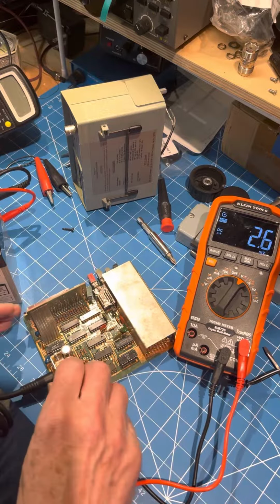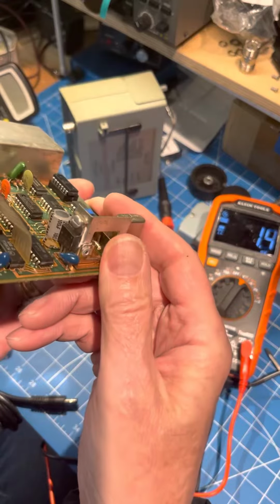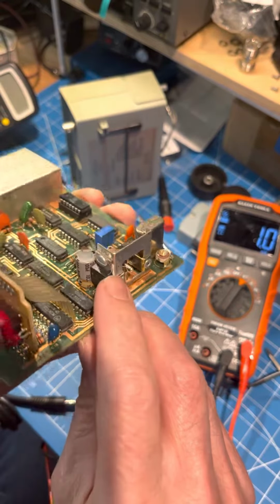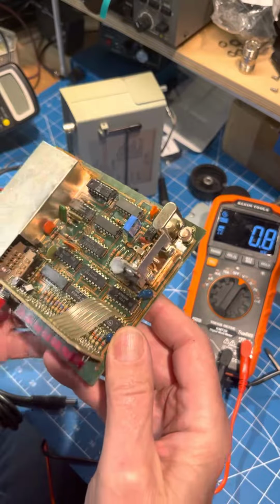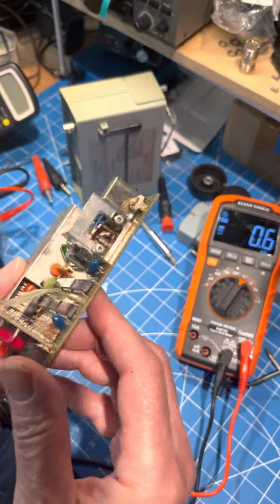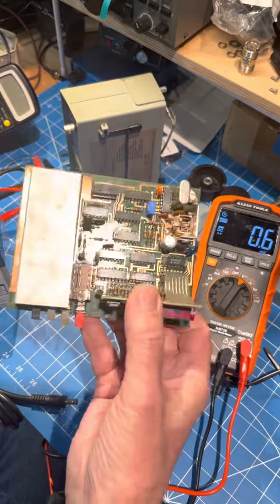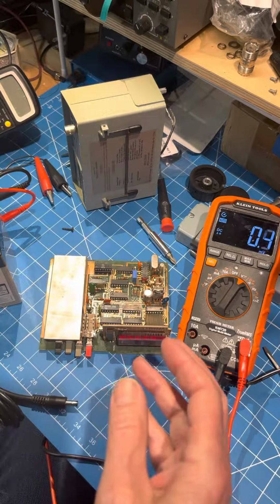So I did take a look. I'll probably try to fix it, even though it's against my better judgment. There is an LM340T-5 in there, which is a 5-volt regulator. That's probably shorted. So I'll order that, and we'll see if number 7, after a brief wait for Jameco to send me a regulator, and then we may have a vintage Simpson meter. But number 6 gets you, again, no payoff, but at least maybe a step closer.